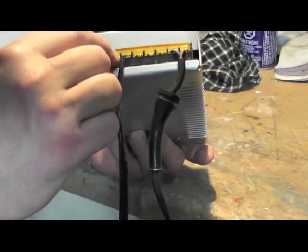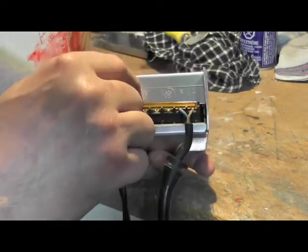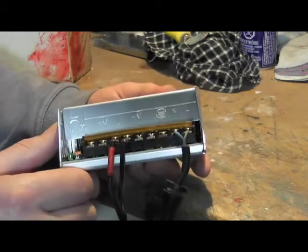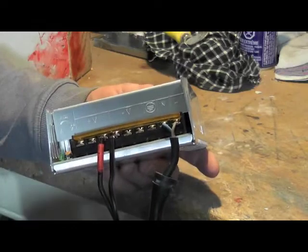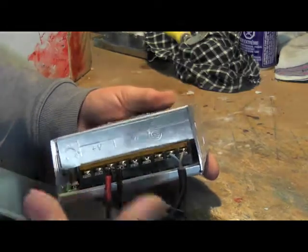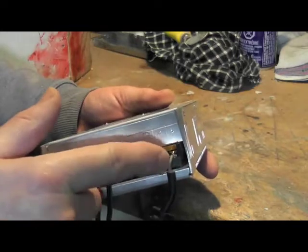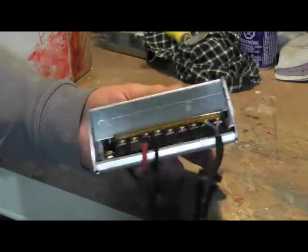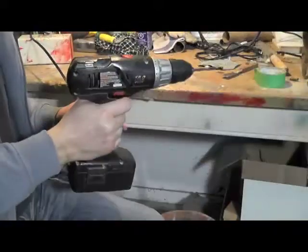Connect the red live to the plus, and the negative DC to the minus V — it says minus V and plus V. Put one on either side and you have your 18 volt. If you've switched them around the drill won't work, so if the drill doesn't work right away you may have them the wrong way around — but don't get these the wrong way for safety's sake.